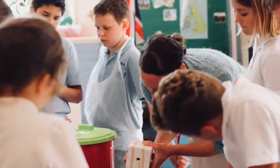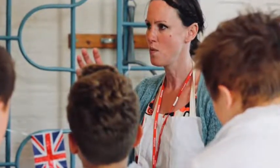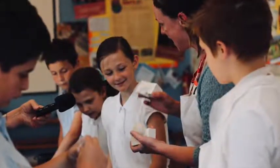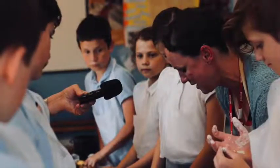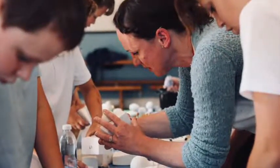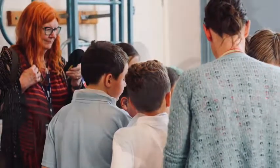So the ones we cast in the first round, you can pick up — just one piece each. Remember it's a three-part mould, so we're going to turn it over and I'm just going to take the two rubber bands off the pieces. Make sure the number is facing upwards — that's the first thing. Then we're going to lift off the top of the plaster mould, and just leave it on its side in the mould to let it dry a little bit more. And basically, that's it — that's how you make your door handle. Have a go, see what you've got.